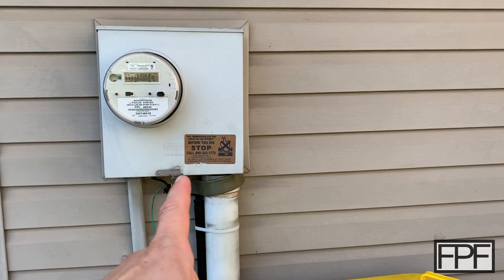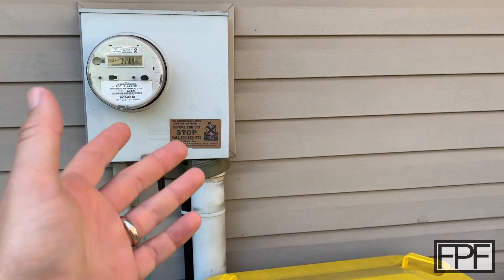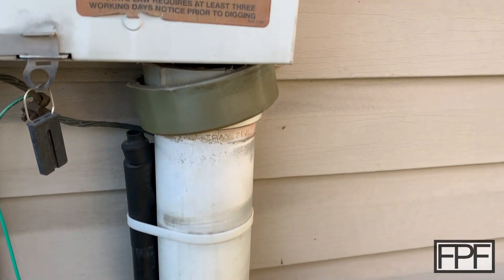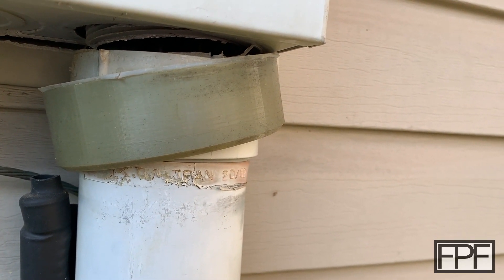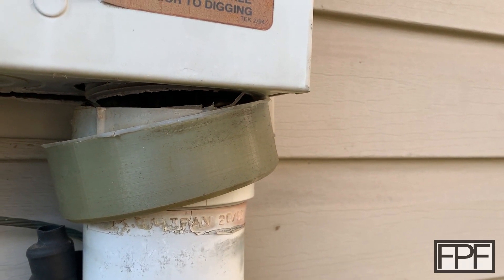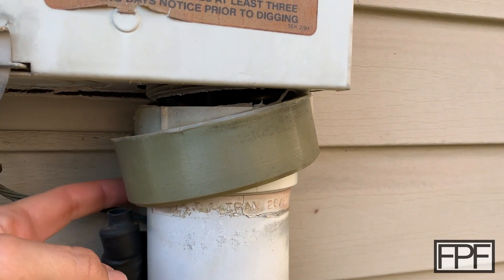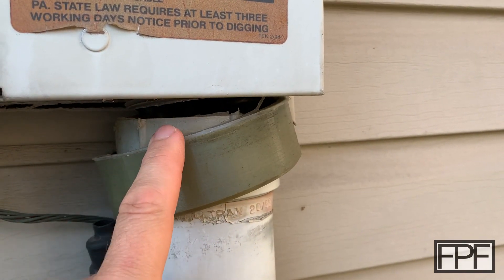This is my power inlet, or my meter base or meter box on the outside of the house, and is fairly common on these residential installs. It looks like the ground must have sunk here, because a couple years back I developed a pretty decent size gap between the conduit coming up out of the ground from my feed wires and the box. I printed this TPU piece — a partial ring, because the conduit's right up against the siding — and put this up into place.